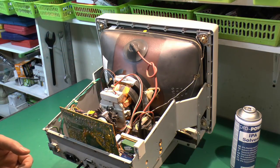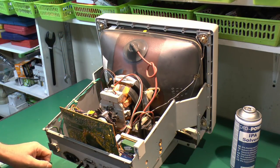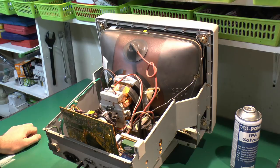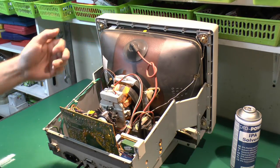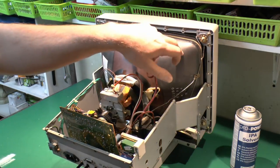And then the other thing is that you may have also heard that these things can store huge amounts of electrical charge for years after they're turned off, and of course that's extremely dangerous. Well, yeah, that's partially true. The thing that stores electrical charge, of course, is capacitors, of which there's a fair number in the bottom there. And of course, the bigger the capacitor, the bigger the charge that's stored. Now, in terms of the capacitors in this one, there's quite a few on the board, which we saw previously. All of those are fairly small. But the biggest capacitor in equipment like this is actually the tube itself, because this is a glass tube. On the inside, there's a conductive coating, and then on the outside, there's also a conductive coating, which is this darker coloured material here, and also over this side here.